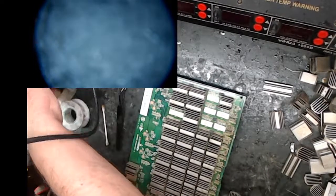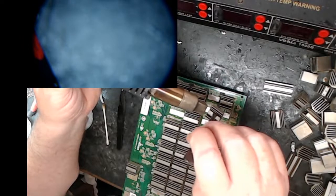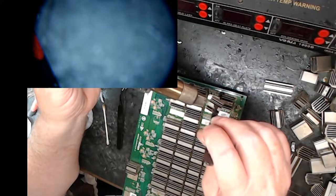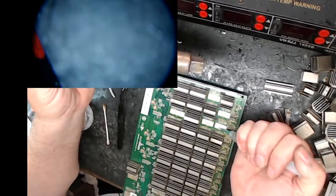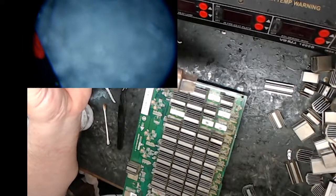Let's see. Be quiet for a while, I count. About 45. I'm gonna put it here because this guy didn't need any extra solder. I do have some 132 here that I'm going to add. I'm just going to add a little bit of solder to these so they're touching better. This guy needs just a little bit on the edge. So he has some extra solder now that when I put this down, it'll make contact and dissipate the heat.